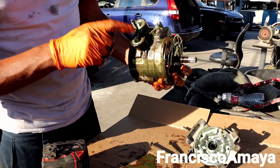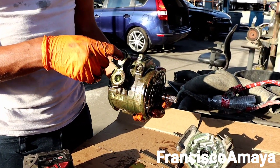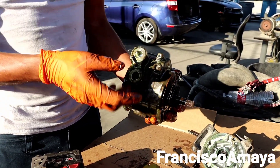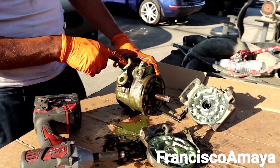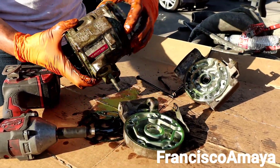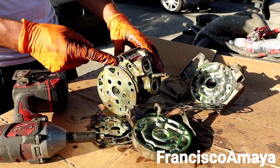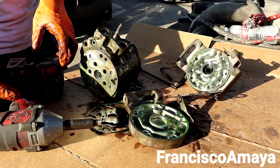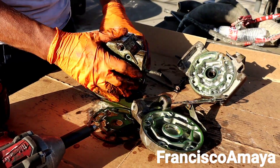This one over here is the suction — this is where the low pressure is, and this is the pressure side; this is where the compressor works. When you rotate this one, you want to have pressure here and suction there. Now I'm going to take this ball apart so we can see how this one looks from the inside. It doesn't want to come out at all.